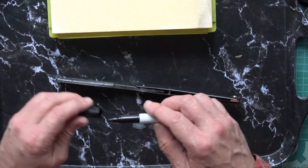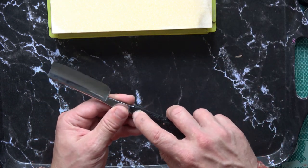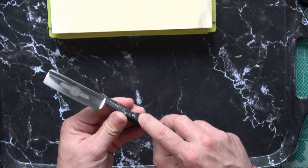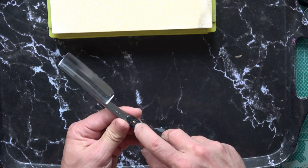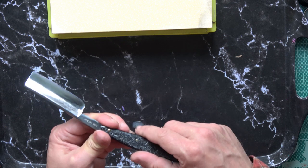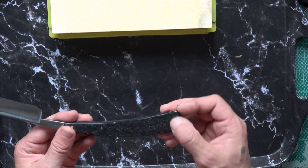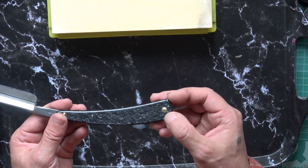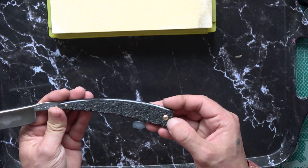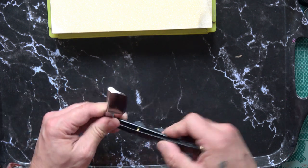Did my pinning quite tight on that, on the pivot. I did quite well with my pinning as well. You can barely tell that the pin's a pin. That one you can't tell. It just looks like a nice little blob of brass. That one you can tell a little bit. If it loosens, it means I can play with that side a little bit. But it is what it is at the pivot end. But the non-pivot end, you can really barely tell there is a pin in the collar at all. It's kind of just one piece, and that's what I aim for. Try anyway.